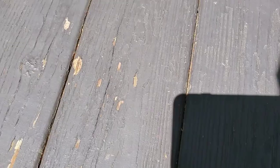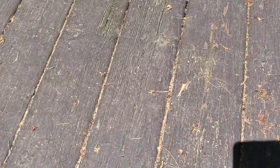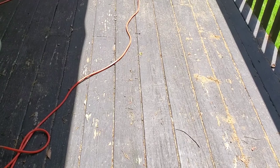So now we have air flow. There's daylight between the boards. Whereas all these boards, they're painted shut and swollen shut and actually installed too tight. It's installed too tight from the start. Very common — you see it all the time. Installed too tight.